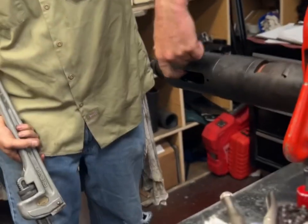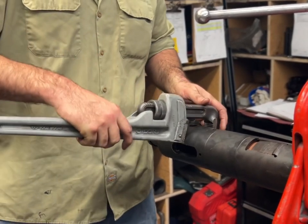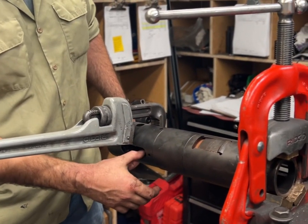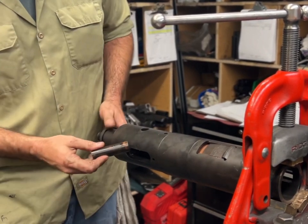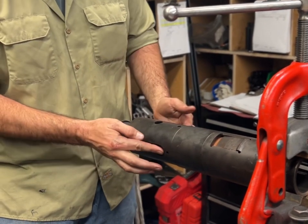Now you have to tighten these two windows up till they're completely flush. Don't put your finger in it, you could cut your finger off. It should feel smooth. Take your core pin, slide it across, it should go back and forth freely. No obstructions, no burrs, no nothing.